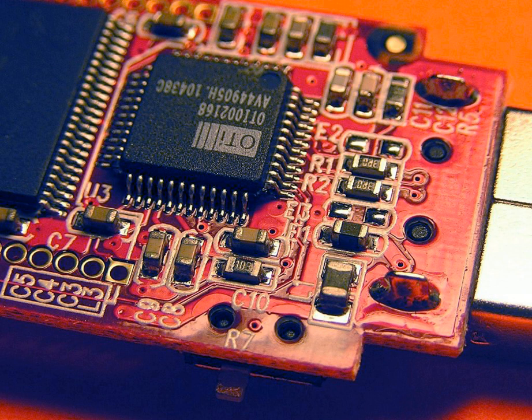After soldering, the boards may be washed to remove flux residues and any stray solder balls that could short out closely spaced component leads. Rosin flux is removed with fluorocarbon solvents, high flash point hydrocarbon solvents, or low flash solvents, e.g. limonene derived from orange peels, which require extra rinsing or drying cycles. Water-soluble fluxes are removed with deionized water and detergent, followed by an air blast to quickly remove residual water.